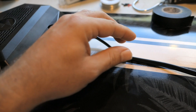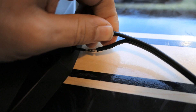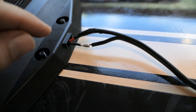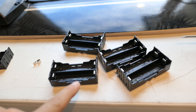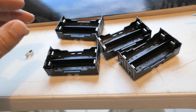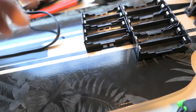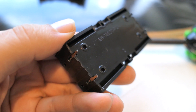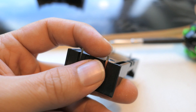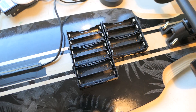I'm using a lamp cord and I've gone ahead and soldered the connectors, then taping one side up. I don't have shrink wrap so I'm using electrical tape, which should be fine. Now we've received the battery holders, so I need to plan the layout — three holders in a row with the BMS here. The little pins on the holders are poking up, so I need to bend them over so everything sits flush and can be screwed down.